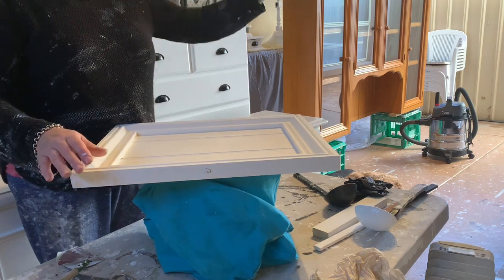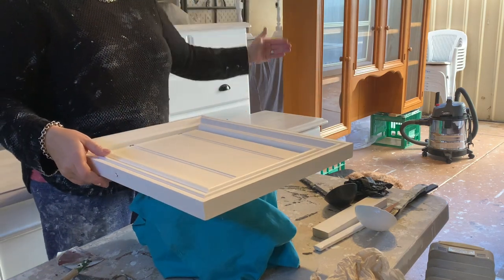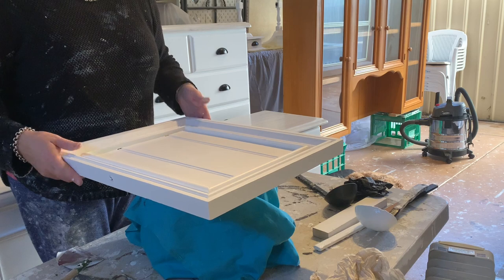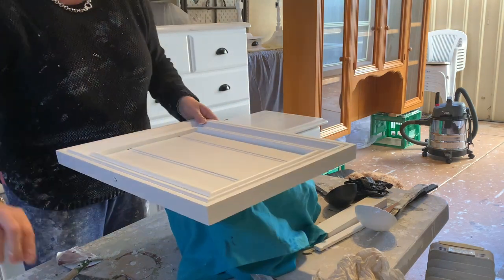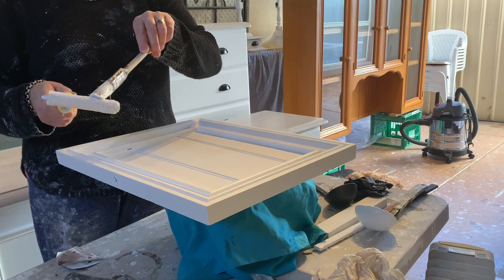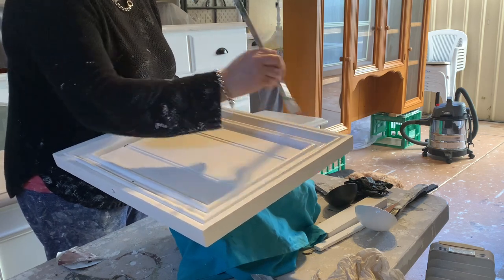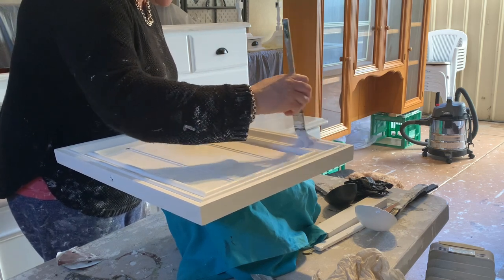I also label the hinges on each door. I start with the first door and it would be hinge one and hinge two. Now this is how I open — I've got my 25mm sleek brush. I just dab it in the paint and take it up onto the roller so there's minimum paint on there. Then I go into every crack and crevice. On this door there are quite a few. It's going to take two coats, so let's get in there and get around. It's quite windy out there today — we've got a mixture of everything in Melbourne. It's 13 degrees with wind, we've just had a bad rainstorm, got absolutely soaking bringing the washing in, and now we've got a bit of sun.